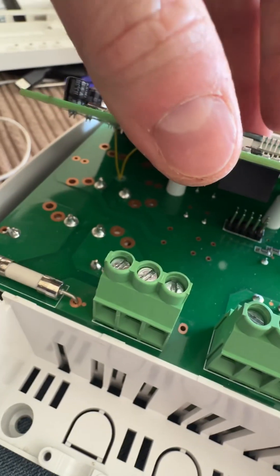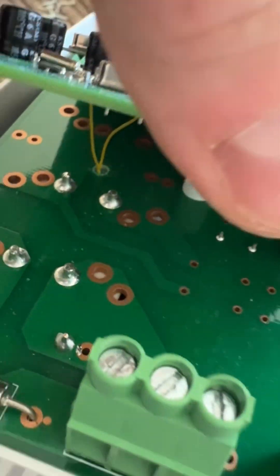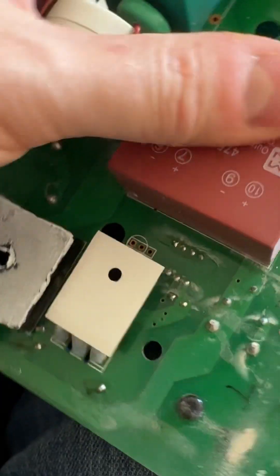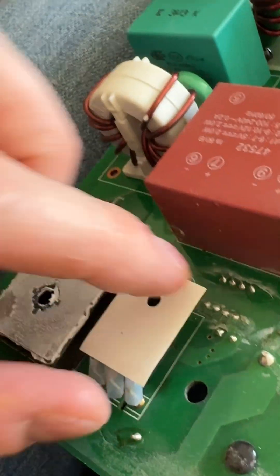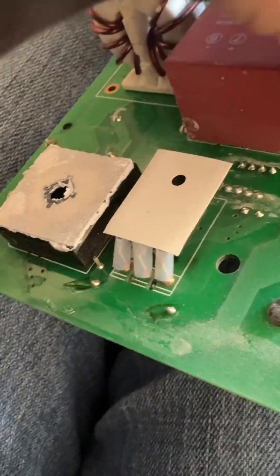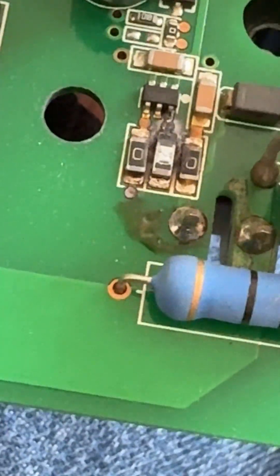How strange - it's another one of these where they've cobbled this in afterwards. After seeing this, I'm hypothesizing before doing any checking that that is short. The reason it's turning on and off is because the new version has some kind of short circuit protection in it. So basically when it goes bad, instead of blowing everything up, it just turns on and off - and that resistor looks like it's gone again.